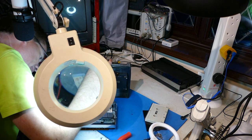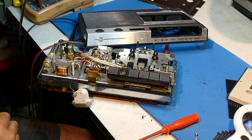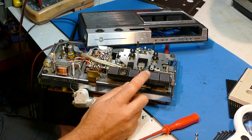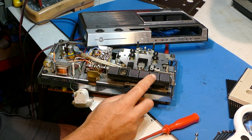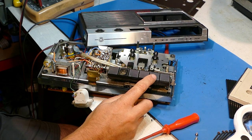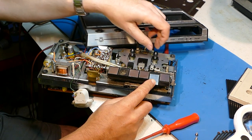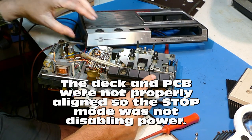Let's reconnect the supply. I'll set the current limit low and switch it on. It's current-limited out. I set it to 9 volts, or just under. It's taking no current. Select fast forward. The motor's running! It seems a bit happier now. It's taking 150 milliamps and fast forwarding properly. But the motor seems to be running on. Can't believe that's right. Volume is set. Volume control's a bit crackly. That doesn't seem unreasonable. There's a tone control.